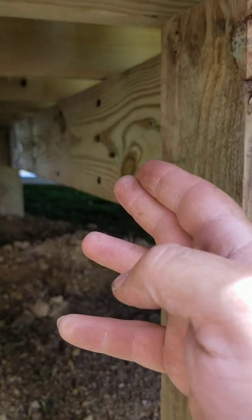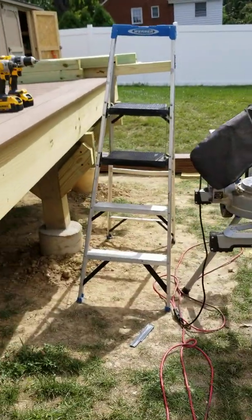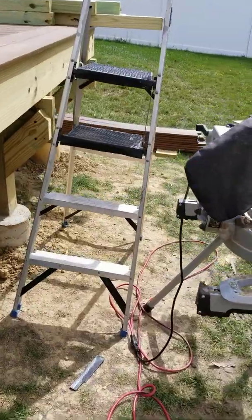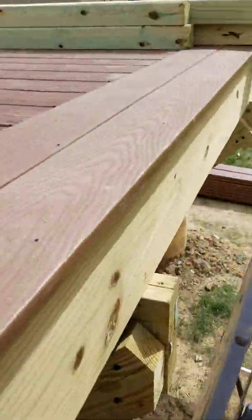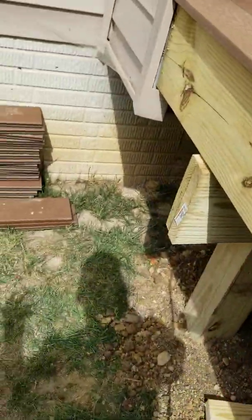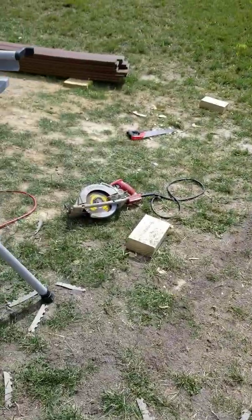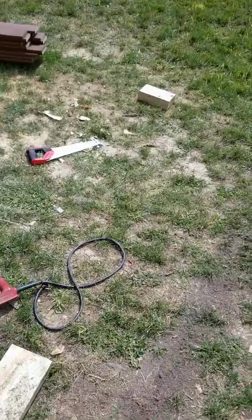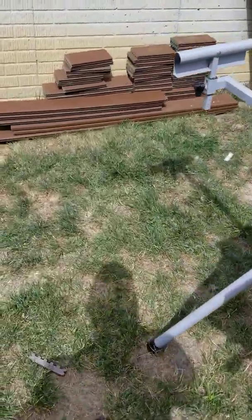What I do is run a series of three every 16 inches the whole way down the beam to fasten the two plies together. Us at Forward Home Enhancements, we specialize in three main things: roofs, decks, and structural beams. We do a lot of load-bearing wall removal and structural transfer work, and we do it frequently, so I implemented that same practice in all the beams we build.